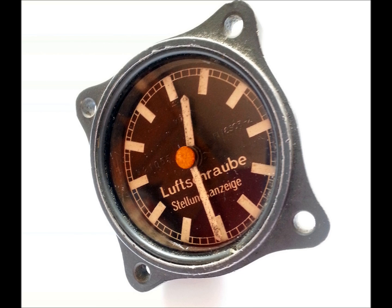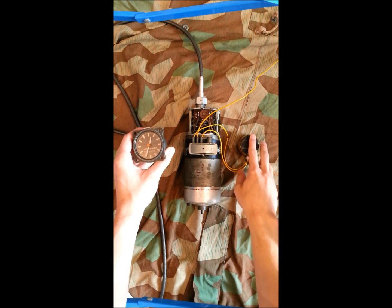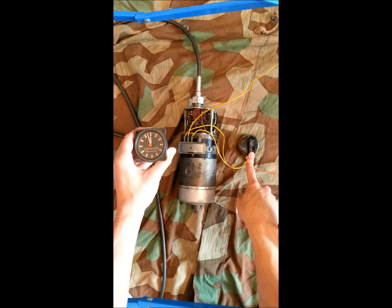When flying, a pilot does not really need to know the exact degrees of the prop's pitch — he just needs to know what indications on the instrument relate to the selection he wants. This same thinking is used in modern aircraft like the Airbus, where the pilot doesn't need to know exact flap degrees, just flaps one or flaps two. There are no markings on the face of the clock; instead it is read just like a normal clock — for example, 10:30, 12:30, 4:30. Pushing the thumb switch to bigger RPM rotates the clock clockwise to its maximum reading of 12:30, which is fully fine pitch — about 22 degrees on the 109.